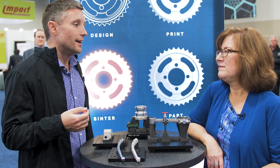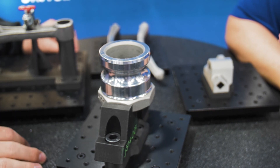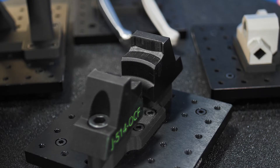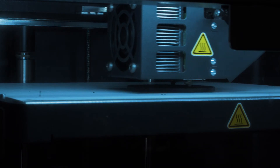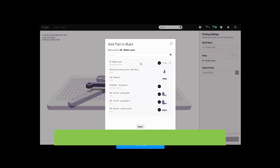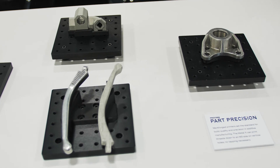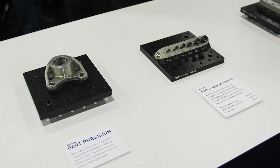Reeling back to metal: it starts in the same application space, because there are many tooling and fixturing scenarios where the surface hardness of plastic won't cut it. That's where the hardness of metal becomes important — gripper jaws interacting with sharp surfaces, tools requiring high chemical resistivity, or areas needing even stronger parts than our carbon-fiber-reinforced parts, which are as strong as aluminum. That's when you look at stainless steel or similar materials. Thank you so much, John — nice to meet you. And that's what's going on with Markforged at Rapid+TCT.